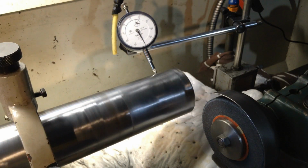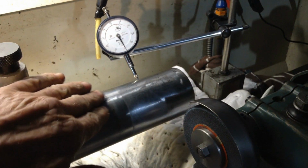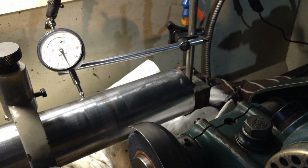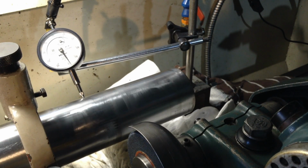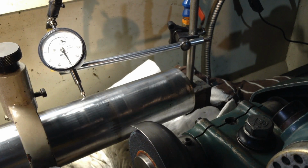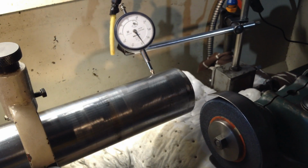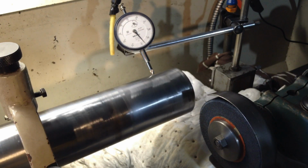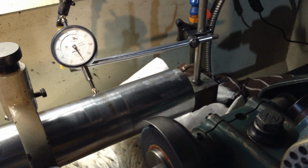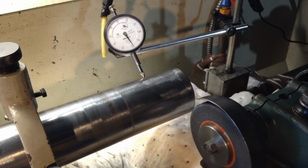So we have to determine how we're going to read this. The shaft, or the wear in the shaft, is absolutely minimal. It's not enough to worry about. So what I want to look at is if I bring the indicator down, start to get a bit more there. We'll bring it around to we're on zero there. So that's actually pretty parallel there. So that tells me the shaft is not bent, it's just purely a bit of wear in the shaft.